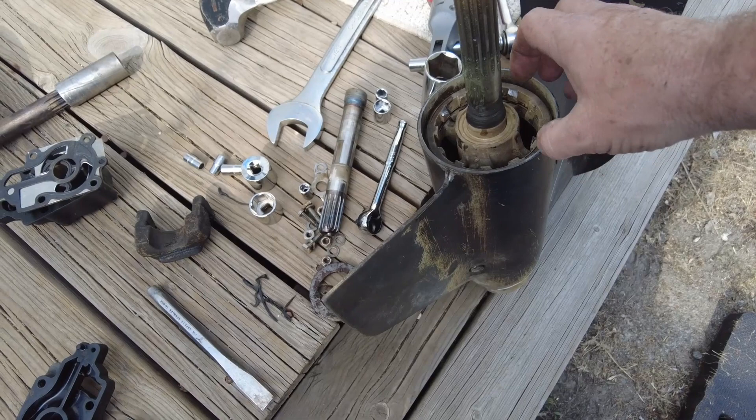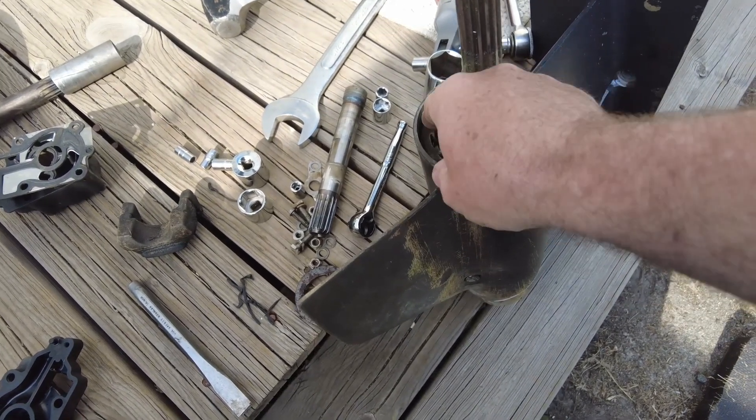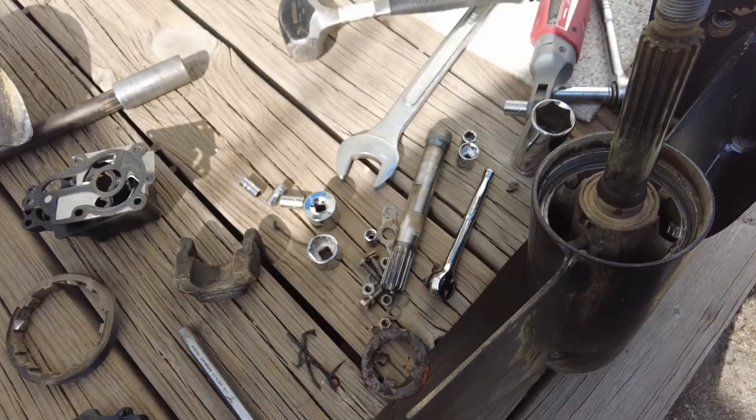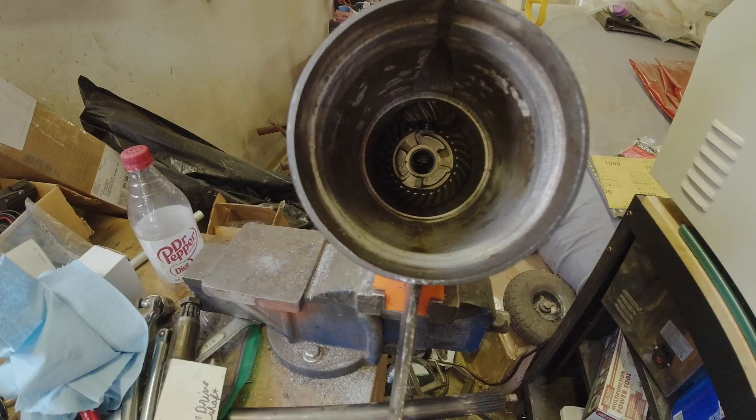The prop came off with no problem — just took a socket on there. And I got the top of the retaining ring out and loosened it up. Way down in the belly of the gear case things don't look like they're in too bad of shape. You can see a little bit of corrosion in the aluminum around the top — I think there was some water in here at some point. But the gears, the bearings, all of that stuff looks like it's in really good shape. Too bad that the upper bearing was in as bad a shape as it is. Check back for the next video — I'll take you through the process of how I got this thing put back together and back in the lake. Thanks a lot for watching.